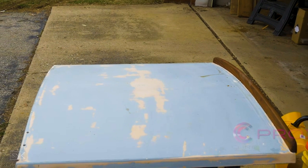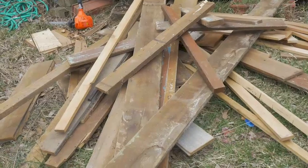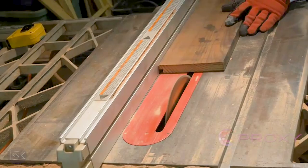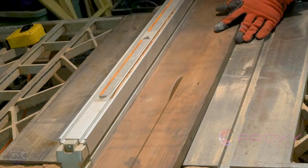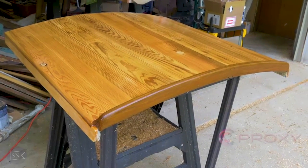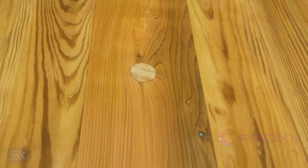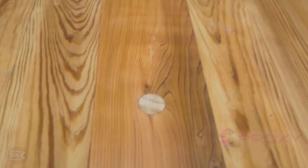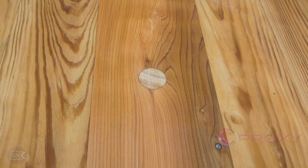The hatch cover was one of those things I wanted to do something with rather than had to, but even with the splash deadline coming soon I really wanted to see what I could do with it. I've always loved the look of a wooden hatch, so I milled some wood salvaged from old houses and made several planks to clad the cover. I used TotalBoat 5-to-1 epoxy to adhere the new planks to the hatch. The two sideboards and center plank are cedar and the other planks are pine. I even filled a knot in the center cedar with a dowel, which gives it a unique look. I sanded it all off and applied some polyurethane left over from a non-boat project — 10 coats — and it looked great, but this finish was not one of my better ideas.